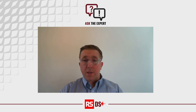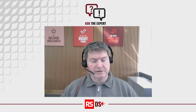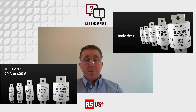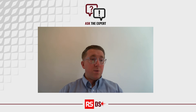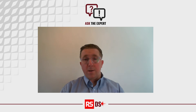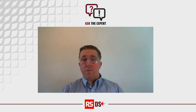In terms of range depth, the FWE currently goes from 70 amps up to 600 amps, at 1000 volts DC and 100kA breaking capacity. We are looking to widen the portfolio, working down to amperages of 15 up to 50 amps in a slightly smaller package — the 10x38 cylindrical style and the 14x51 cylindrical fuse — alongside the current range based on a North American cylindrical body.